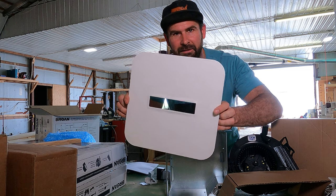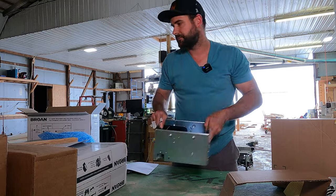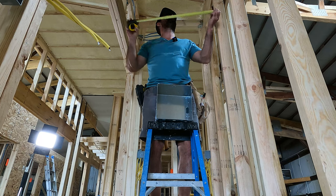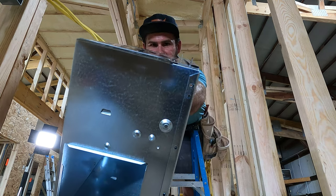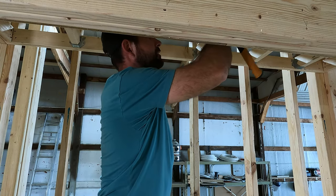This needs to go back in the box. I hate nailing these boxes up — I always hit my fingers or I'll slip with a drill. Look at those tabs. Those tabs center it up for a half inch piece of drywall, then I'll come back and put some screws in. This way you put a couple nails in there, and if it needs to be moved later you can do that.